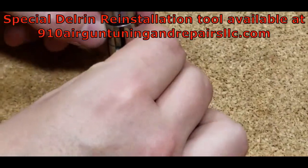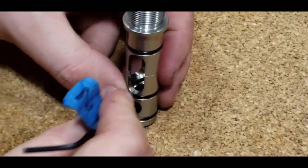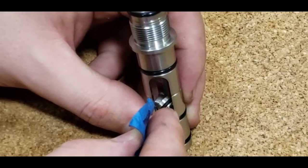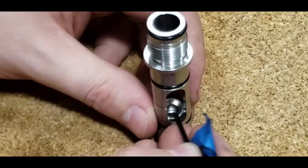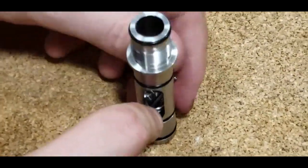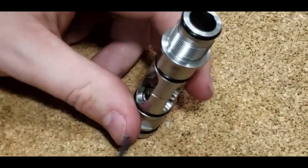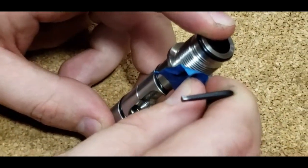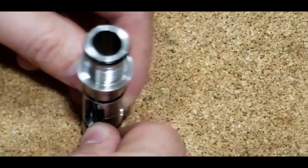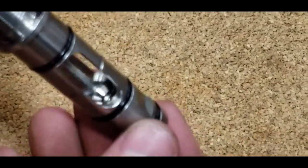To reinstall, you can just slide it through here and line it up correctly, which would be the side that has less O-ring on it — or where the O-ring is closer to the end — that's the side that goes down. Stick the Allen key across and press it in. Installed.